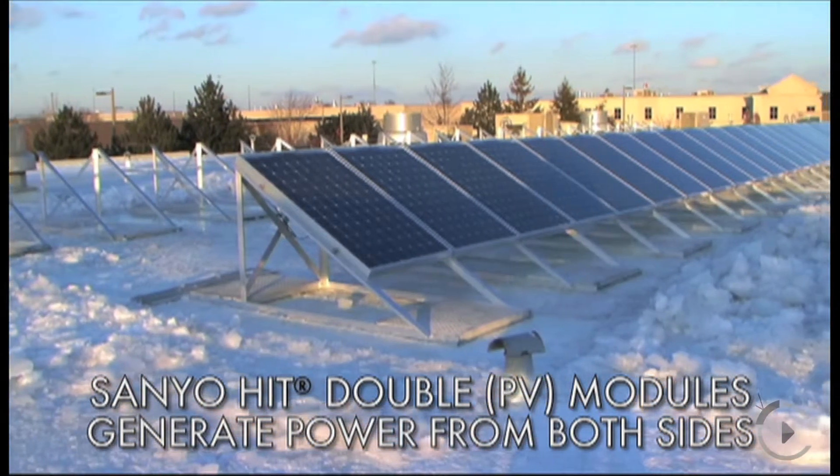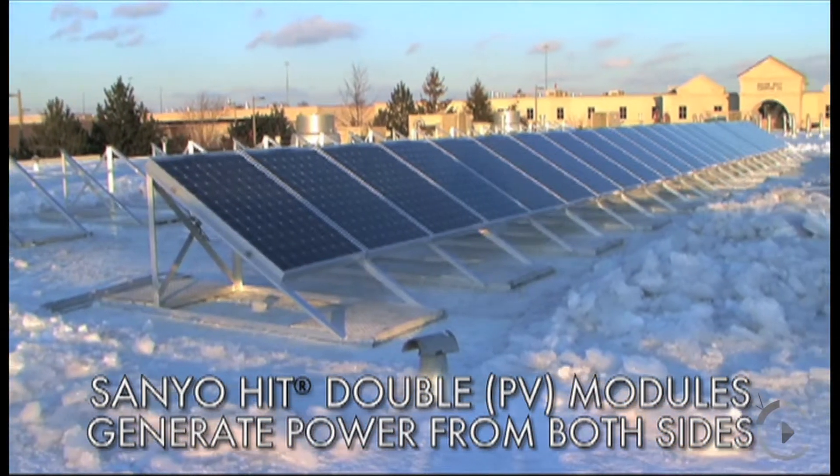It will always give you this reflectivity, meaning that sunlight will not penetrate into the insulation — it will bounce back — so we actually call it a cool roofing system. Is this good for the environment? Oh, absolutely. It's completely water-based and there are no solvents or VOCs in the product. It's called a low TG, which is the glass transition, meaning there are absolutely no solvents other than the water-based acrylic technology.